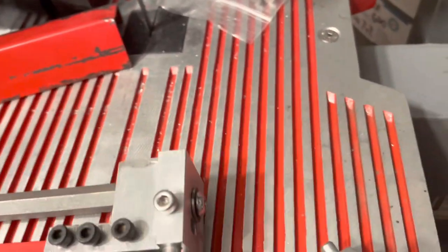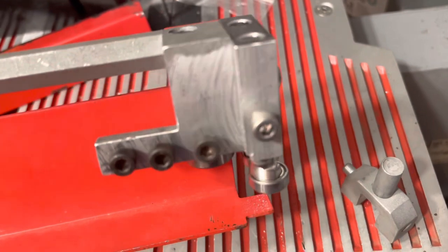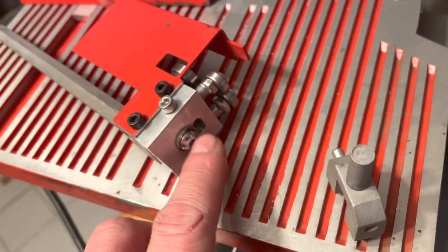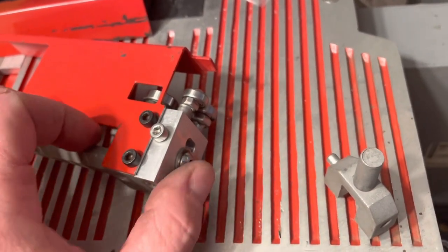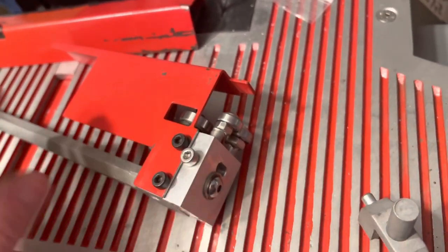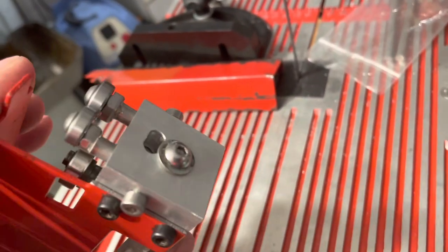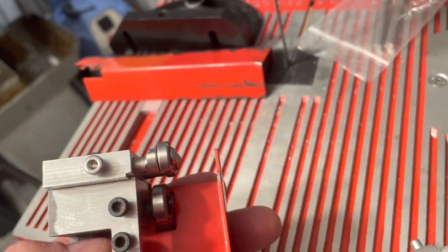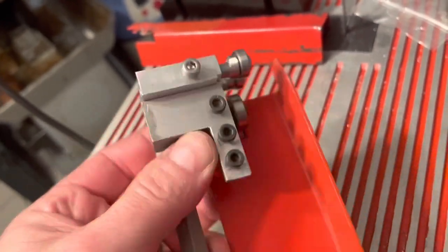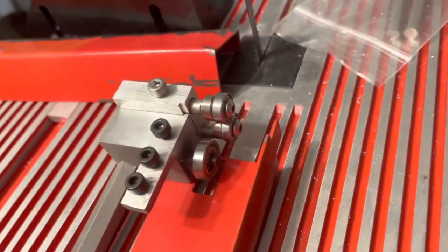What was a little annoying is that in this block here in the middle, there was sort of a hole. So it was a poorly cast aluminum that I had some difficulties in putting the M5 thread that is here, that is used to mount it in. But at the end I ended up with these thread repairman sets that I own, and I put a metal spring thread thing in this housing here, and now the screw can be tightened properly and it works fine. Besides that, no magic, but astonishing how long it takes just to mill such a small thing and mount it to an existing system. Nevertheless, I will put it on the bandsaw and show you how it works.